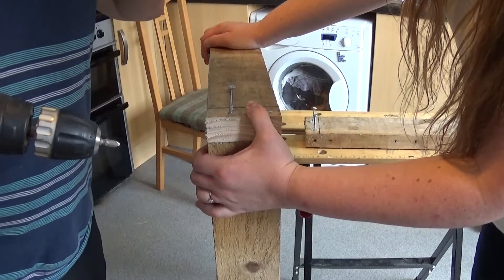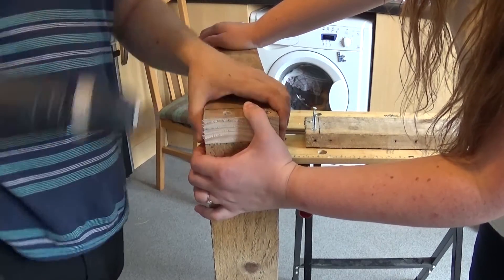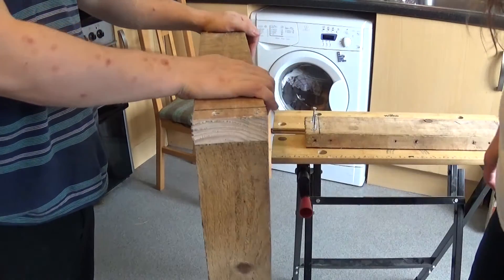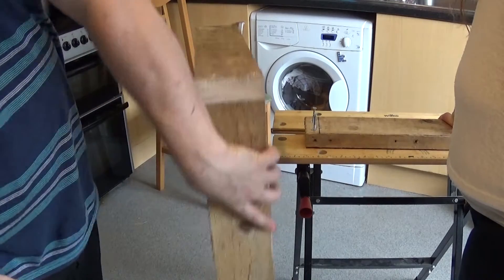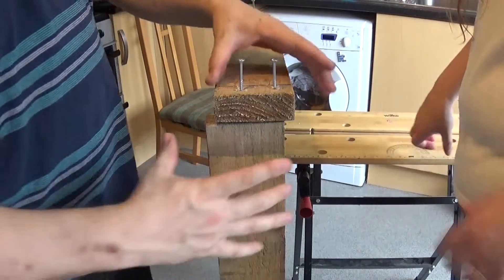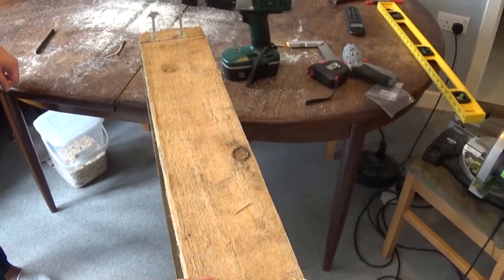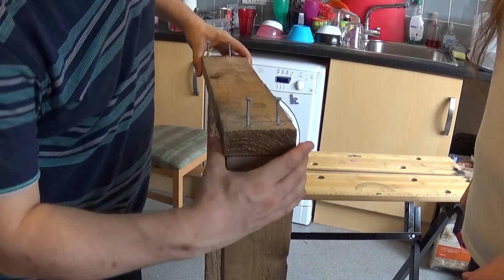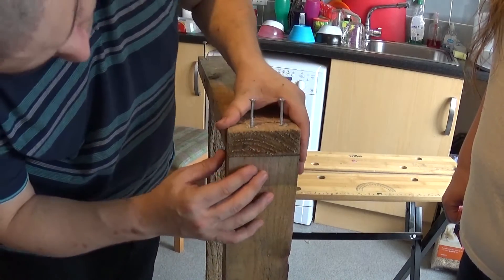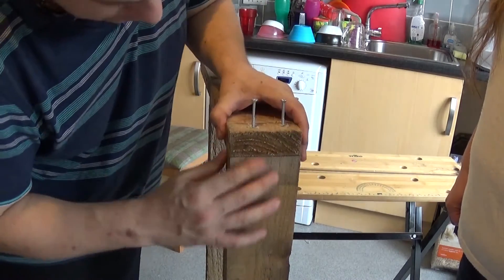As I went in then you saw the whole thing just rock a little bit, so come back and make sure everything is square. That's the first side, and that's basically the hardest side to do because you had to hold everything tight. For this side, get your piece of wood and plunk it on the top. All the same things apply — make sure you get it in the right place. Your other side won't line up initially, but once you've screwed in one side you can twist it and it will twist itself into being square.